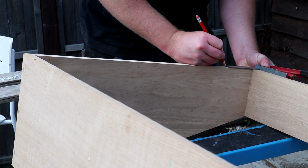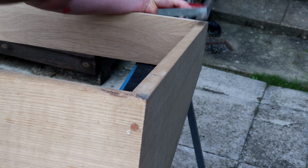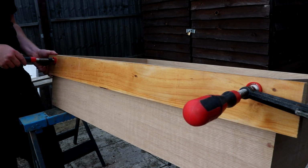The next improvement that I wanted to make for this dog bed was to make a lightweight base for it. The previous dog beds that I made had solid MDF panels, and those made the dog beds really heavy, which meant moving them around was difficult, and when they eventually sold on my Etsy store, sending them via a courier was really expensive. First, I marked up where I wanted to route a rebate to the inside bottom edges at the front and back of the bed. I clamped on a piece of wood along the long edge to give the base of the router more surface area to rest on. That worked really well.